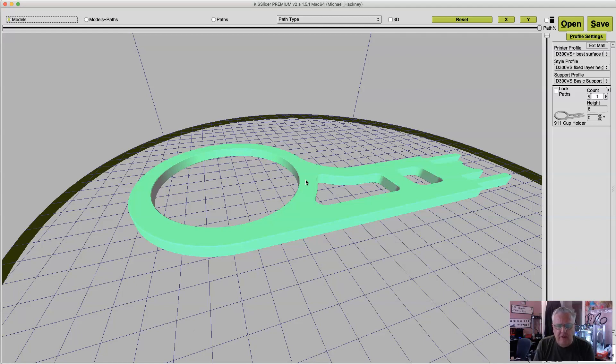For parts like this — this is a cup holder for one of my cars — the top surface is going to be extremely visible and I really want it to look as good as possible. Normally I play the trick of printing upside down so the visual top surface is on the bottom, but in this particular case I actually want both the top and the bottom of the part to look great. So ironing is going to be used on one surface, and the PEI bed gives a beautiful bottom surface.